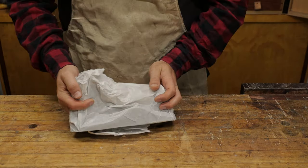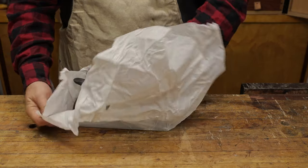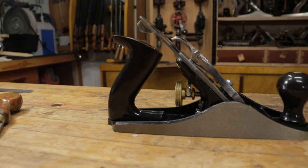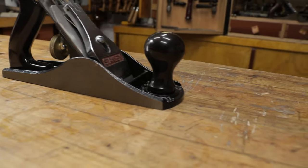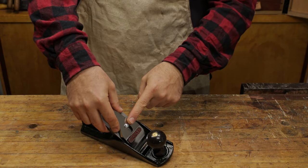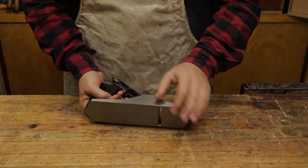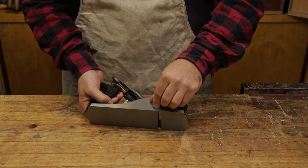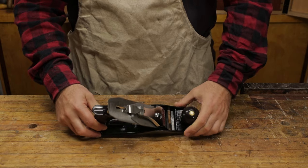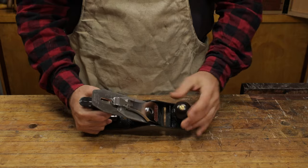What you're all here to see is obviously the hand plane. They've got it wrapped in this sort of wax grease-proof paper to prevent the plane from getting rusty. Out of the box you can see the hand plane looks fairly nice. We have plastic handles and a chrome plating on the lever cap. It feels like there's some sort of coating on the sides of the bed to prevent rusting — some sort of film finish. Looking here, the casting is quite rough on the bed. It's painted — it doesn't feel like japanning to me, it feels like paint. The front knob is a little loose so we'll have to tighten that screw up. The back tote doesn't move at all, which is awesome.